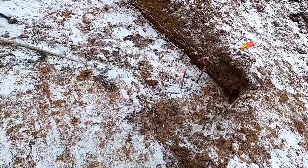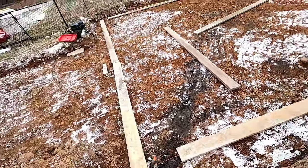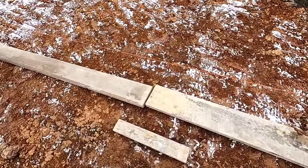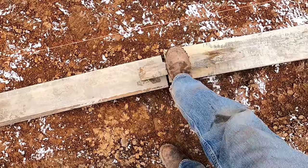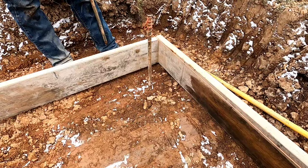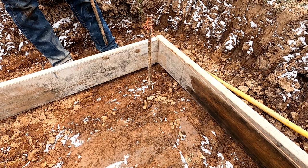Now I got that orange line up, I can take this back line down and start forming. We got boards laid out all along the outside, got this gas line out of our way — going pretty good. I'm gonna start screwing these boards together. All we do is wherever the boards meet, just put a scab on it, screw it together. Outside form corner put together. Now we got to make sure we're five inches off, so how the outside wall line runs together — eights and tens, it doesn't matter — we know we have to go five inches off of this line all the way around, and we'll figure out the inside later.